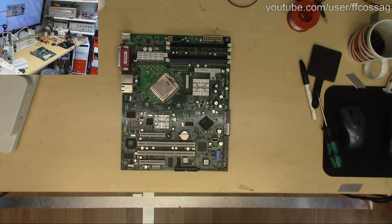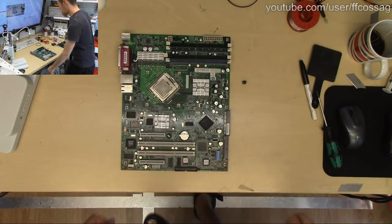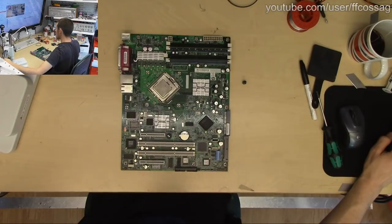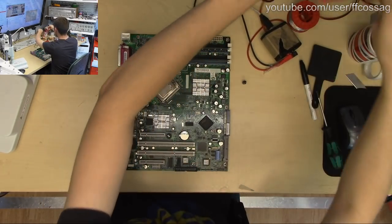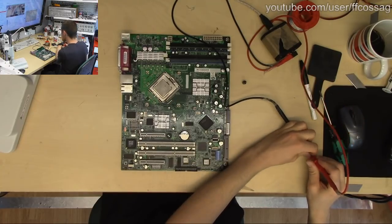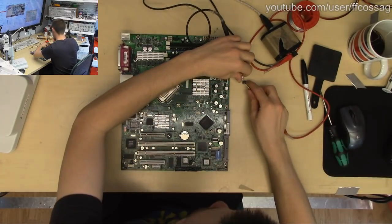Let's see, do I have 820s? I have second-hand 820 microfarads, 6.3 volts. Perfect. Second-hand 820 mic Panasonic. I'm just going to check that with the ESR meter to make sure it's still good. And you guys are not going to see this because I don't have any kind of screen capture set up for the big PC, sorry. But you're going to have to take my word for it. I don't usually save bad caps, and I went through this storage not too long ago, so it should be fine. Zero leads.